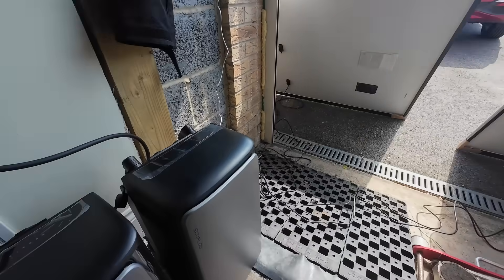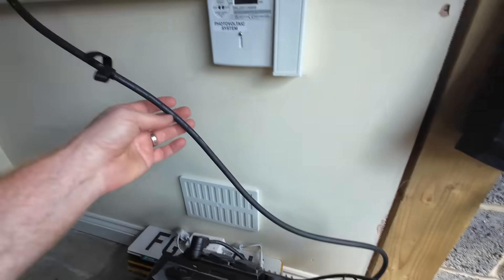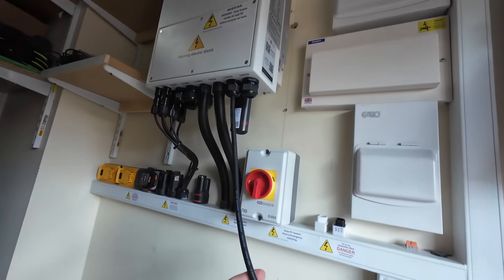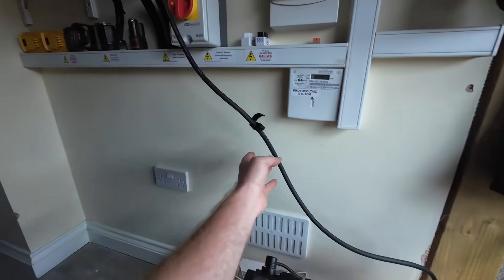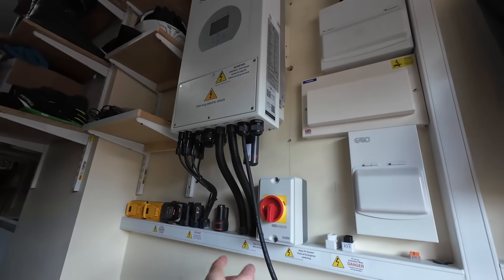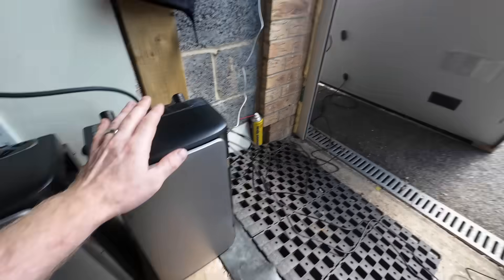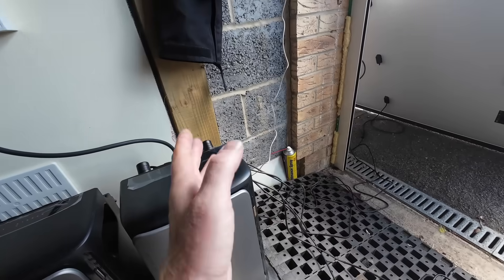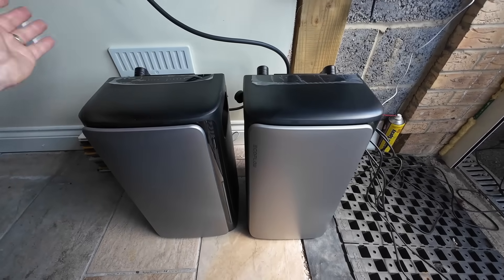Although it's two 450-watt panels, we're getting about 700 watts from the pair of them, which is great with some intermittent cloud. This is connected to my SunSynk inverter - I have a micro inverter input - and I've had a competent electrician wire the EcoFlow Ultra's cable directly into the micro inverter and adjust the settings. I can now choose on the app whether the DC panels are exporting to the grid, covering a base load, or charging these batteries.